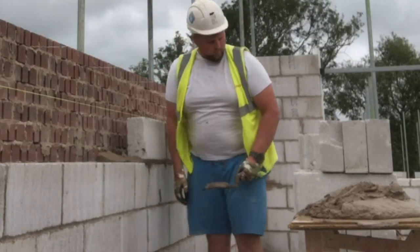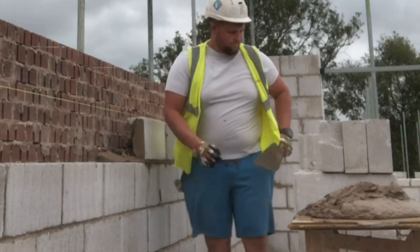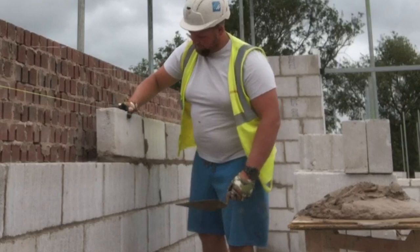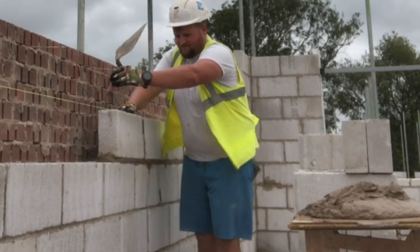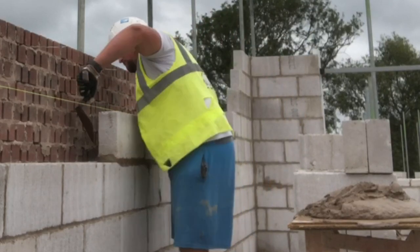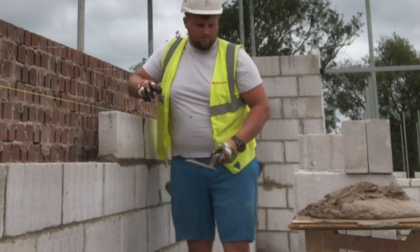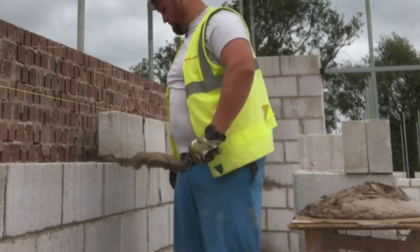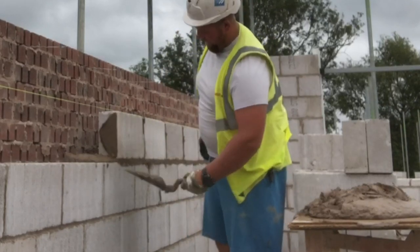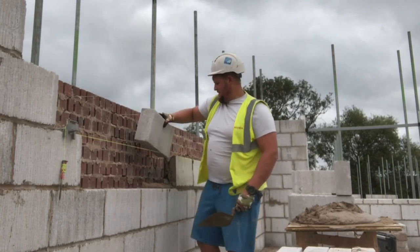The old man slowed me down a lot, to be quite fair, because he lobbed all of our spot boards off the scaffold instead of putting them in the tub. He's a bit inexperienced when it comes to loading out for plots, loading out for housing. He doesn't know where blocks need to go. Luckily on this site, they spray on the floors where we can load the blocks, because some floors for some housing firms don't take load very well. A lot of times they have to acro the floors up, because they tend to bow with high levels of weight on them with all these blocks.